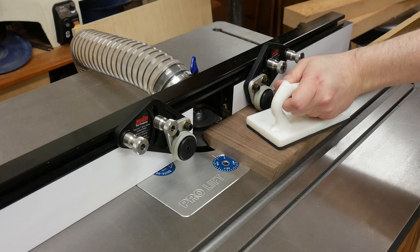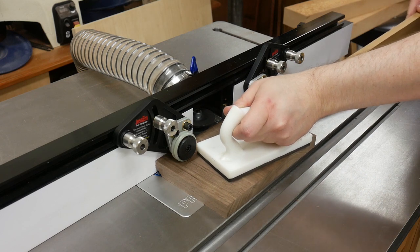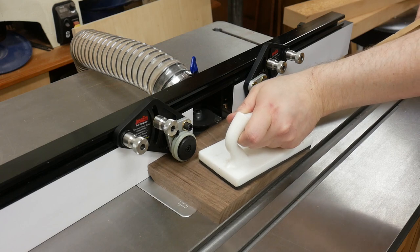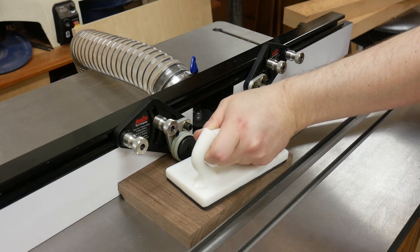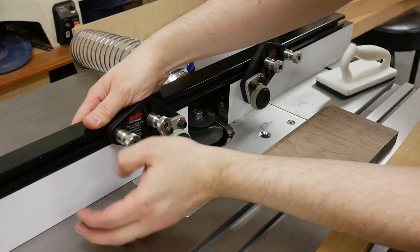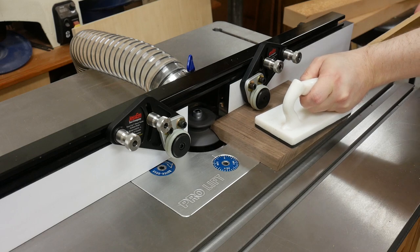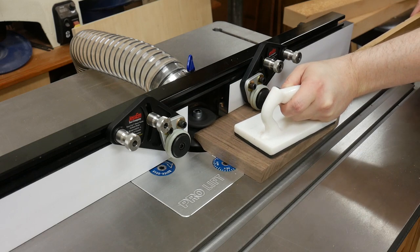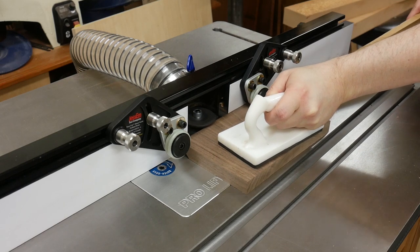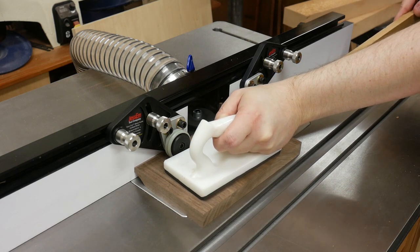I had to move the fence back four to five times to get it even with the bearing on the router bit. This bit is really large, so you need to run your router slow and take your time. Another tip: if you're running your piece over the bit and it's chattering or vibrating pretty crazy, just run it over the bit one more time before moving your fence back — this ensures the cleanest cut possible and that it removes all of the waste.